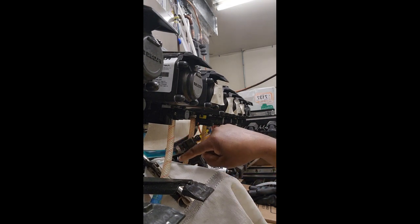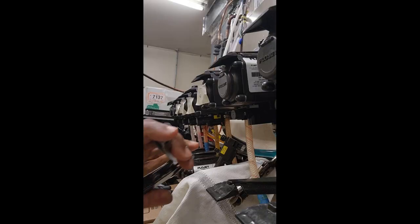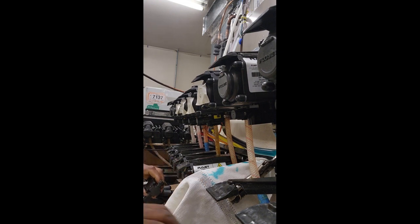Grab my cutter, I'll cut that line, and then reconnect it to the new one. Let me just grab some clamps and some cutters. Should be good. This is one of those sites that's a little ways out from my normal service area, so it's been a while since I could come out here, and since I saw the call this morning, I figured I might as well get these all swapped out while I can. Alright, so I'm just gonna cut through this line here. It's gonna be a little leakage, like I said, but not much you can do about that.